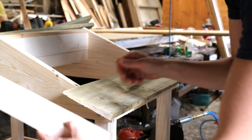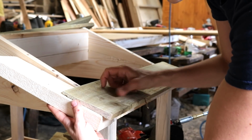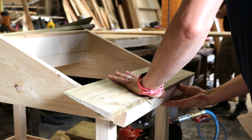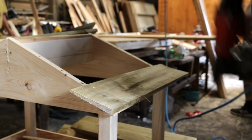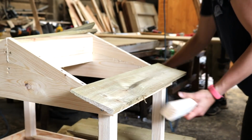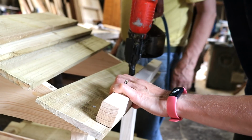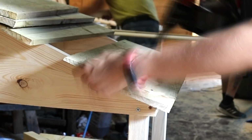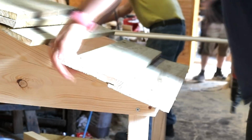For the roof, back to those offcut lap panels. These are pressure treated, and overall, as you've probably noticed, this project is great for using offcuts. And I overlapped them by about 1 inch, with the thickest edge facing down towards the slope. Although I had to take my time while lining up and nailing because the top's apex frame was quite thin.